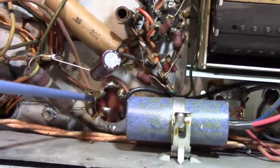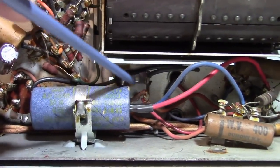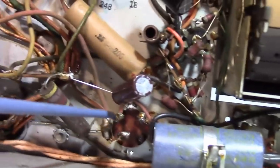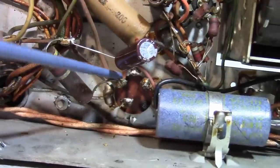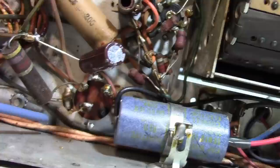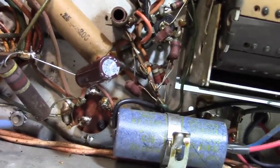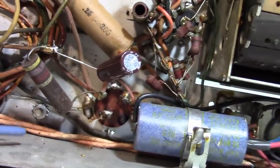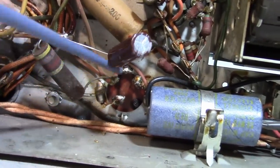Well, there's a wire coming off of this going over to this terminal strip. It's just got two lugs, B plus and ground. We can put the cap right there. But I want to get this one out of circuit. Crude way is just cut this off and wrap it in electrical tape. But that means I have no hope of ever restuffing this can if I choose to go that route. I don't know that I will, but if I cut that lug off, for sure I can't. Or I would have to find another similar looking can, restuff it, and replace this one with it.